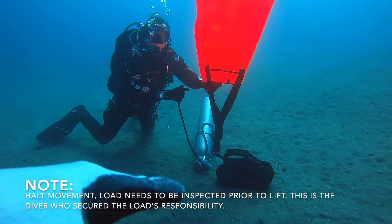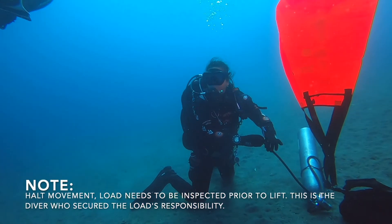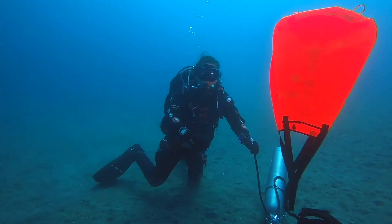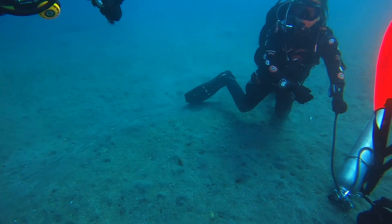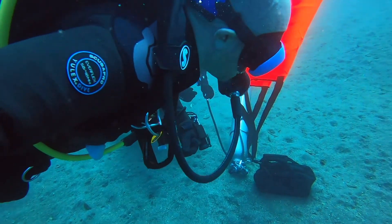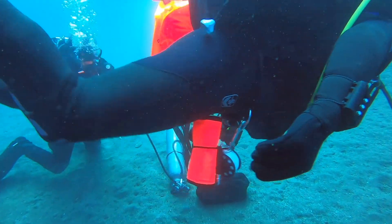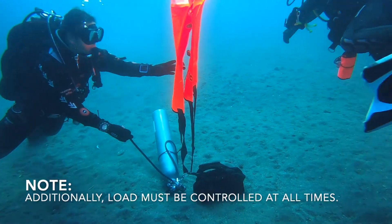Of course, for training, this was all simulated. From here, they selected the appropriate equipment needed to perform the recovery. They calculated that they needed these two lift bags for the volume of gas necessary to lift the bag off the bottom, and an appropriate cylinder size with the amount of gas needed.